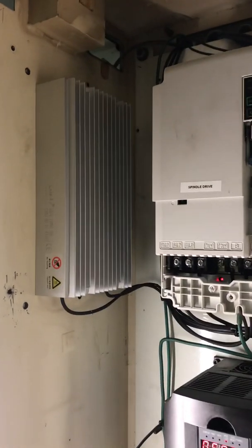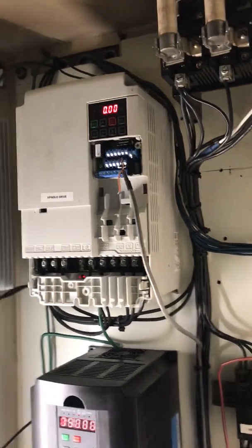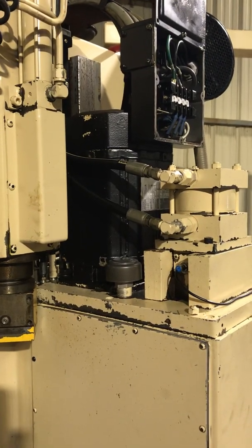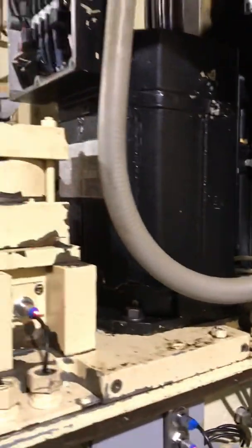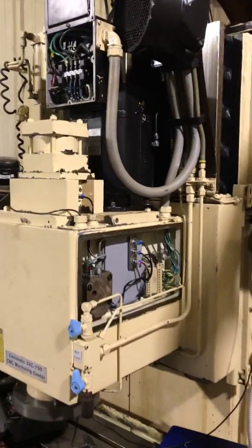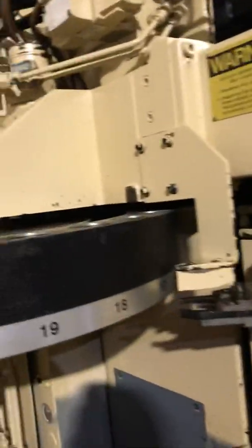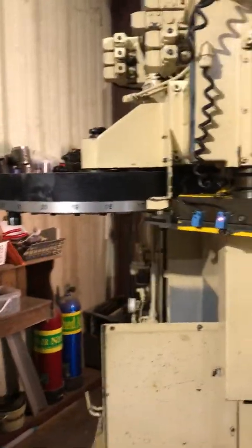There's a braking resistor on the LS drive — it's an S100 series 15-horse, but I'm only using a 5.5 kilowatt motor, which is like seven horse. Full power goes from 3.7 to 5.5 kilowatt. I had all my inputs set up and I got Sam — he's got a YouTube channel — and he's doing the macros and the brain for my ATC setup.